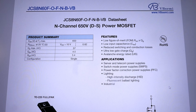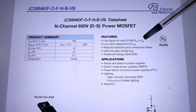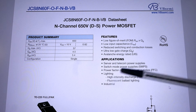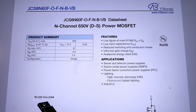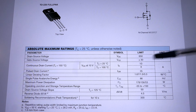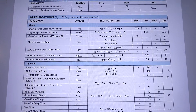That's an interesting metric. The more powerful the transistor, the lower the on-state resistance, but this typically brings a higher gate charge, making the gate harder to drive — harder to quickly charge and discharge. So if both are low, it's actually quite a good transistor. The datasheet mentions high-intensity discharge lighting and fluorescent ballast applications — probably not written recently. Continuous drain current when hot: 8 amps. The 10-amp rating at 25°C is a useless number. On-state resistance: 0.82 ohms.